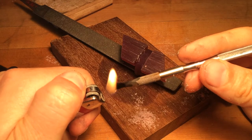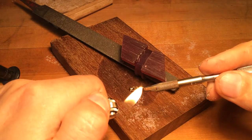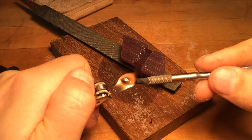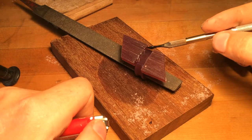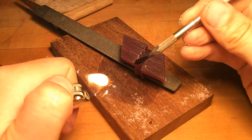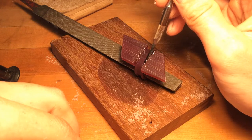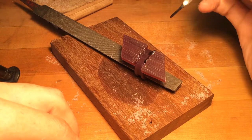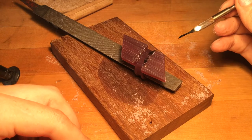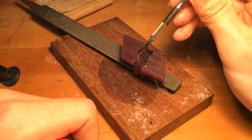I'm going to heat up my tool nice and hot, then use it to actually pick up all the fluffies. You'll see that it starts to create a very thick glob of wax, and that can be deposited for building up. Then I'm going to get a nice clean fusion line by just drawing my hot tool right along the seam of the two parts. Now we know that that's a strong bond, and we're going to do the same thing on the back side.